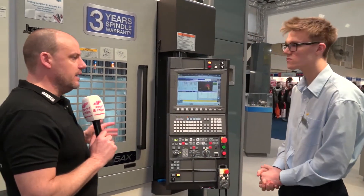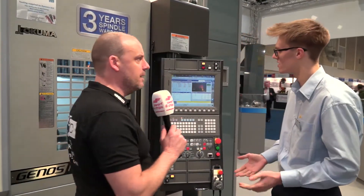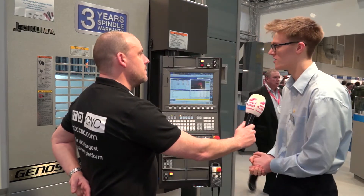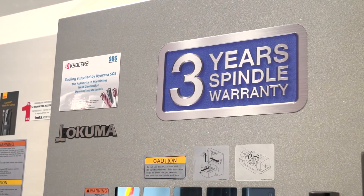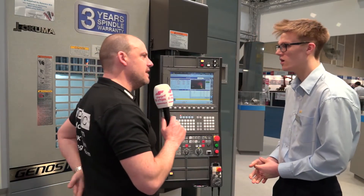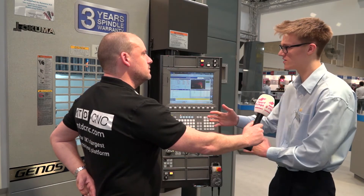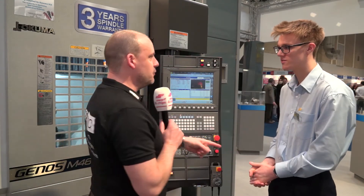Let's summarize what this machine comes with as standard. Everything I've talked about - thermal compensation, through-spindle coolant - it all comes with the standard package. There are no options, it's all included in the standard price, and it comes with a Renishaw probe as standard. There are 32 tools in the magazine, and they tip the tools up before the tool change so you can fit more tools in with less space - when it comes round it has more clearance to select the tool. How long is your apprenticeship? Four years. Good luck with the rest of it!